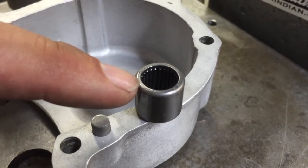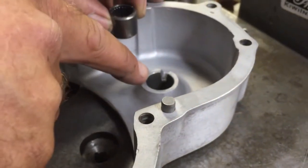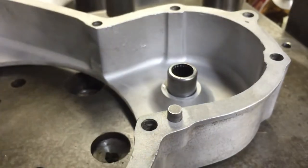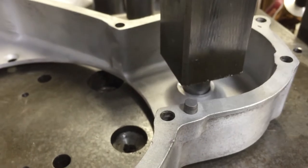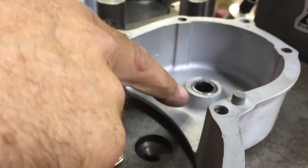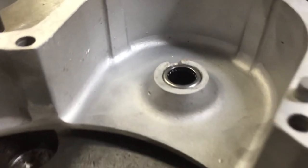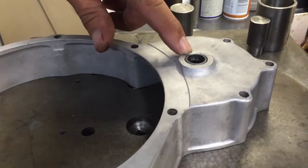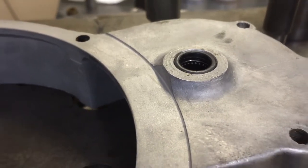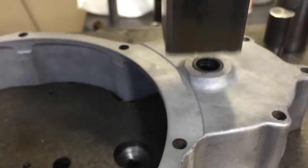We're going to press against the flat side of the bearing. We've already put some light oil on the inside of the bore. Don't tap bearings in — they need to be pressed. Don't be getting a hammer and punch or anything like that. Push down the arbor press until it's nice and flush with the top. It helps if you put a good-size bevel to lead in the seal, and just press it in with an arbor press or a punch mandrel until she's flush.